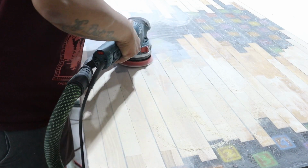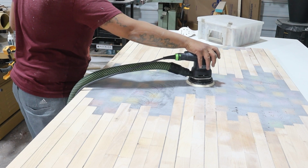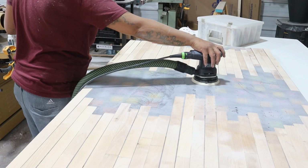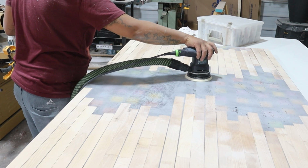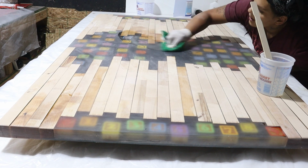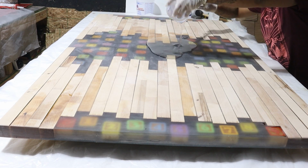So this sander right here is a freaking lifesaver. It has the turbo mode. I will link it in the description. It is the Bosch turbo sander, and I use it to just get rid of all of the lines and the marks from the router sled. So then after all that's gone, I jump over to the Festool. I go up to 220, and right here you see me cleaning everything with isopropyl alcohol and moving on to a seal coat.